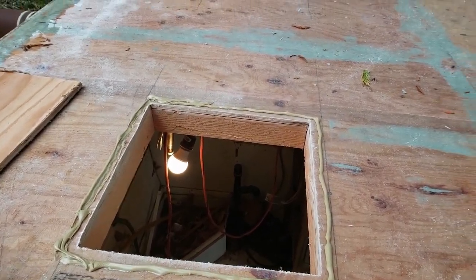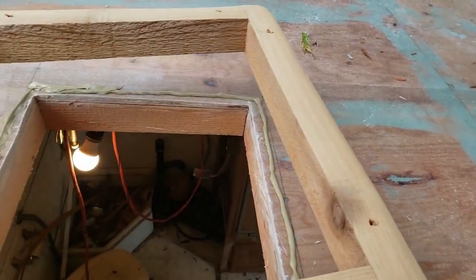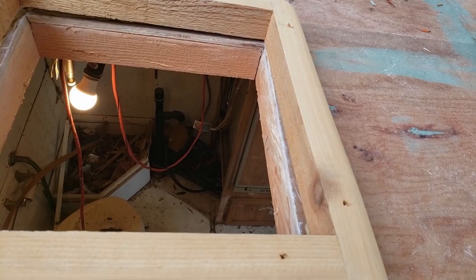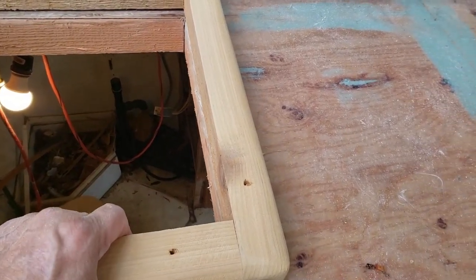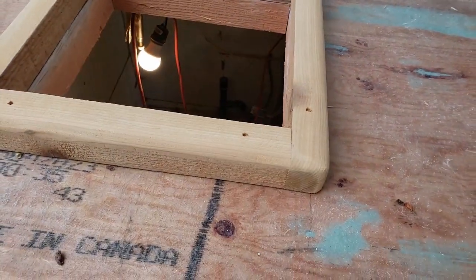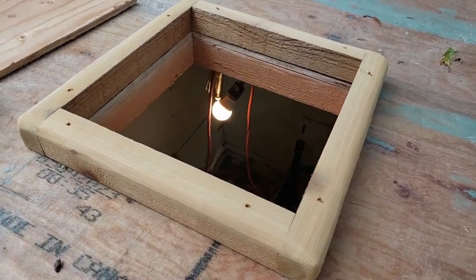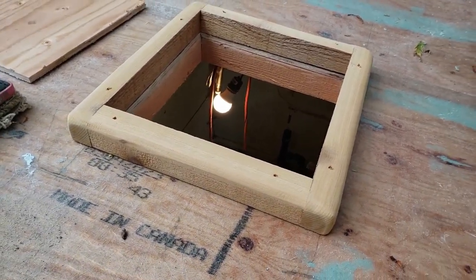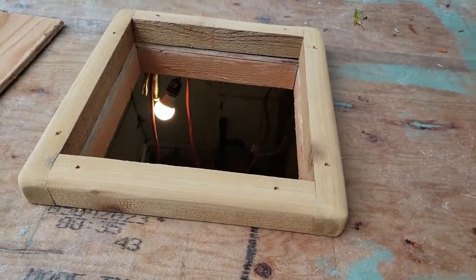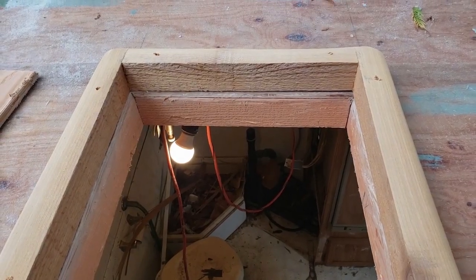Once the curbs are built, we just put some polyurethane glue around the outside, which is subfloor glue, but polyurethane will stick to the fiberglass really well. We like to use polyurethane glue, which is subfloor glue. I'm showing you the edge, how it's rounded over, the corners around it, the top edges around it. Once that gets fastened down, then we can saturate any raw wood.